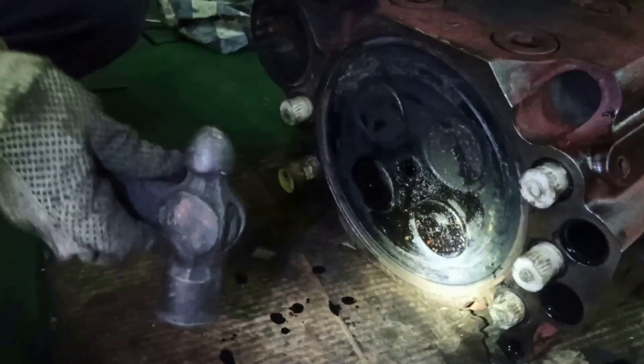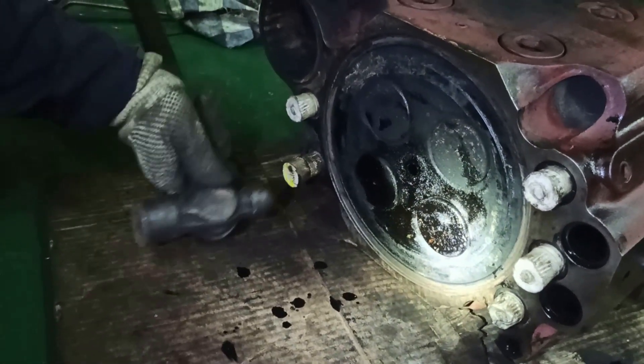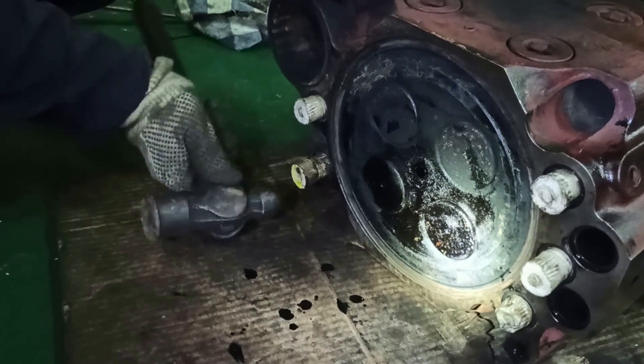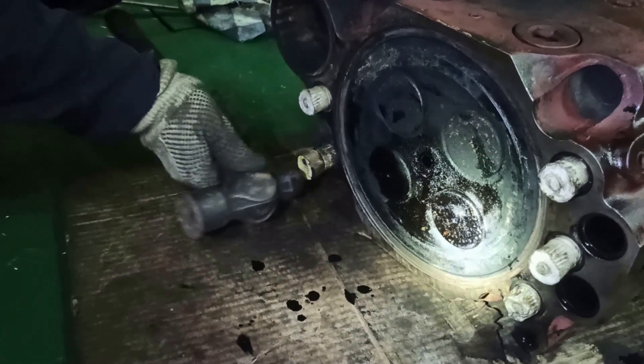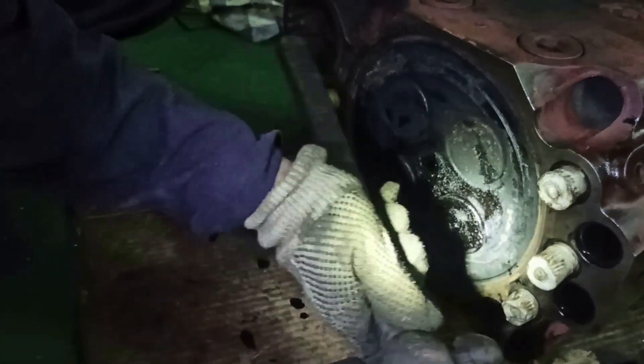Number three is cylinder head crack — if the cylinder head has a crack, the cooling water will also leak inside the cylinder. I decided that we will pull out the head for a pressure test to investigate where the source of water is coming from inside the cylinder.